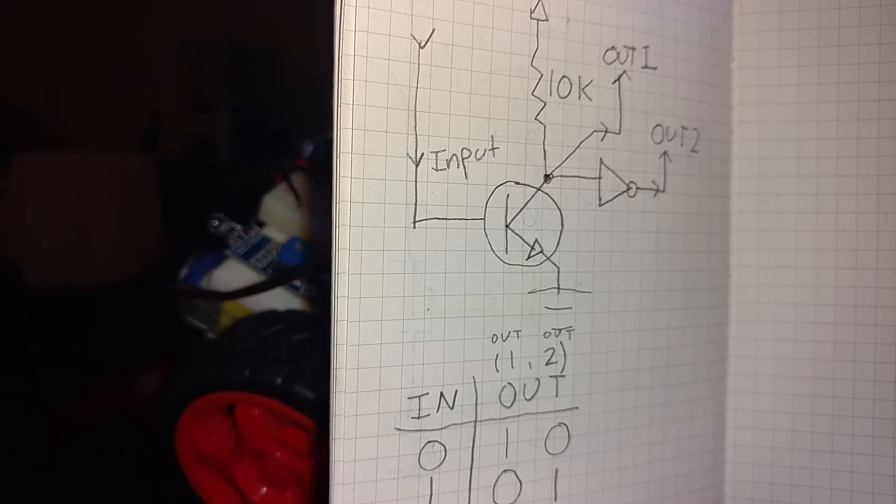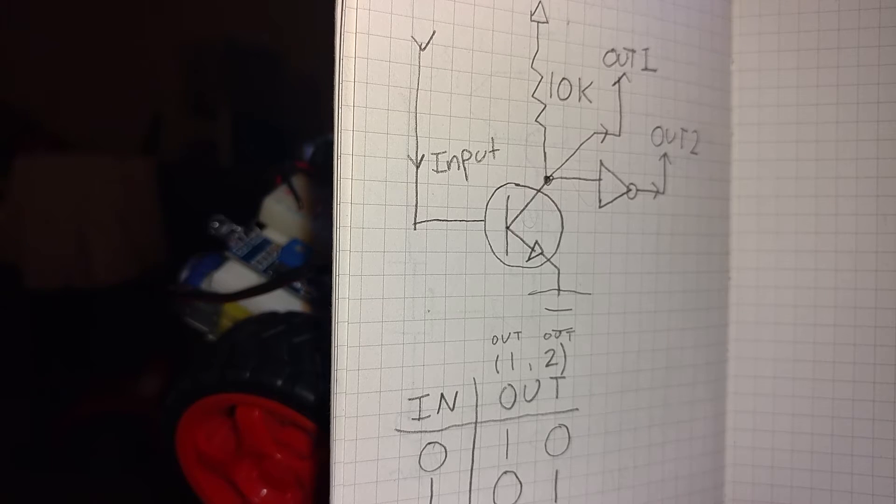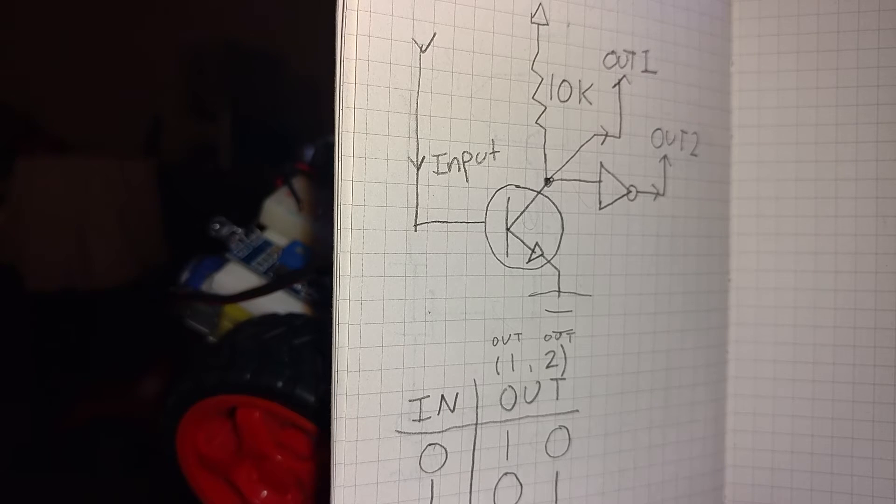This simplifies control because you've got two sides of a robot, which is only two inputs, and you need to get four outputs from that. So what that does is it either makes the motors go forward or backwards, and you can have the four combinations depending on if each side is given a 0 or a 1: forward, backwards, turning left, turning right.